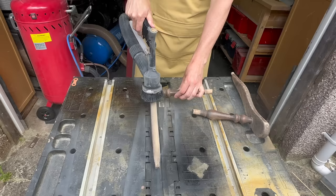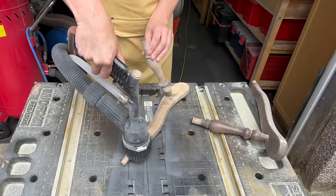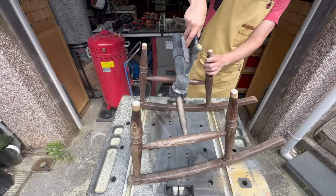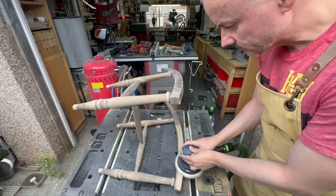When I was done applying the glue I started stripping the varnish off all the pieces using my sandblaster with built-in vacuum - I have the link in my favorite things on Amazon and I'll try to put it in the description because lots of you have been asking about it. It's super cool but not perfect - it doesn't work great on varnish that's in very good condition or very thick, but if it's something a bit worn out it's just amazing and makes everything super easy, especially on pieces like this where regular sanding would be quite impractical.